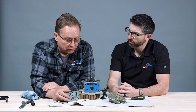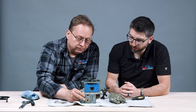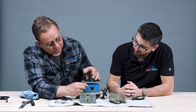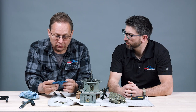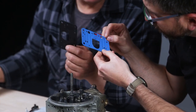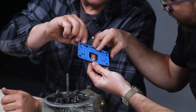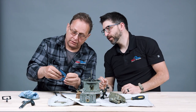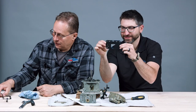That's another issue with carburetors — there's probably a bigger chance of getting dirt in there than with fuel injection, where air filters may be better in some ways. This block is called the metering block, and there's one for the front and one for the rear. When installing new gaskets you should always match up the new one to make sure you have the right number of holes — turn it around and make sure you're not missing a hole. That's how easy it would be to screw that up.